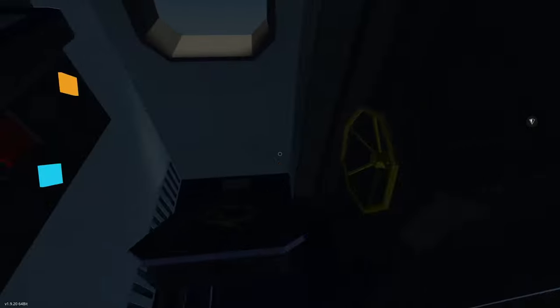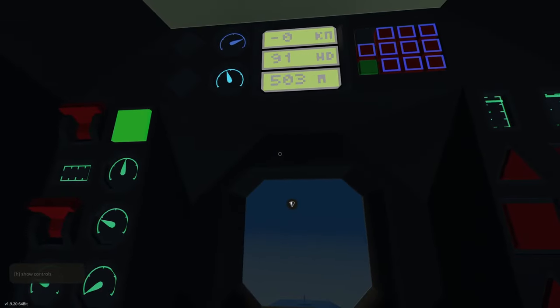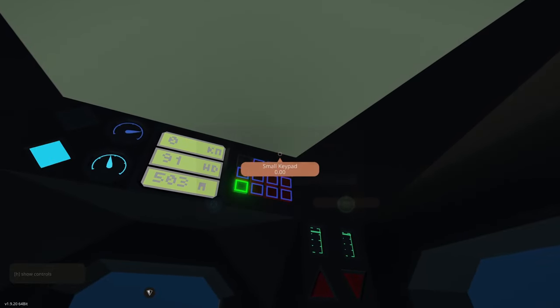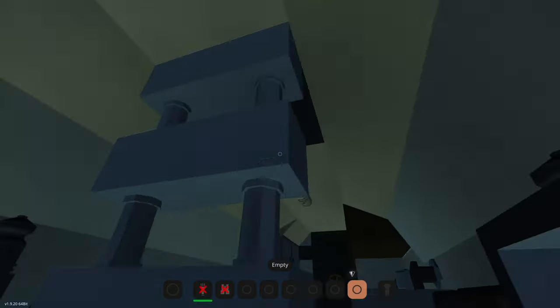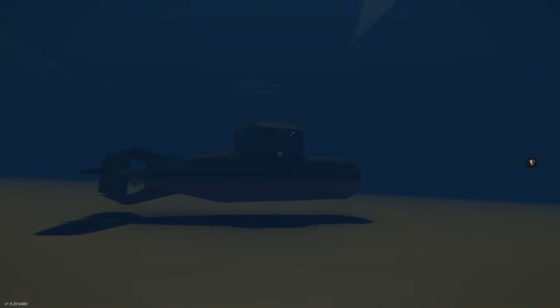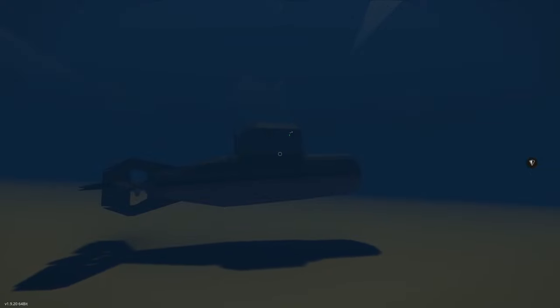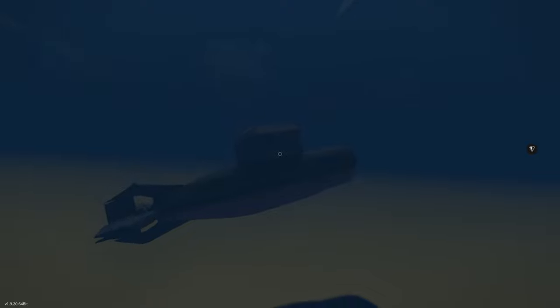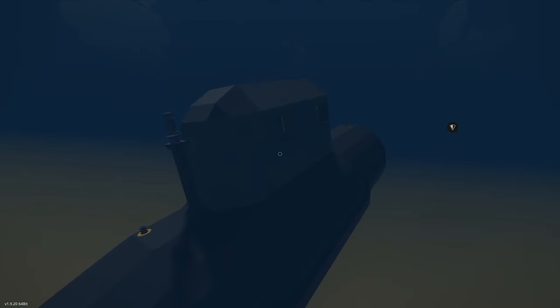Our water is now at zero — it recovered all that water and expelled it. Let's go back into the bridge. Say we're doing an emergency surface — the seat automatically slides back. All we have to do is go to the keypad and enter in a zero. As you can see, it's going to fill the ballast tank with air, pressurizing it and helping get the water out. As we become lighter and lighter, we'll start to rise. We are now positively buoyant. In an emergency you can just put a zero in the ballast system and rise to the surface. Even with full ballast tanks you have enough engine power to push yourself to the surface, but buoyancy alone will work.